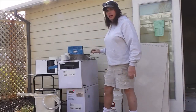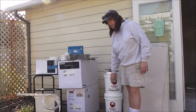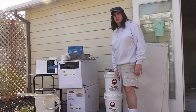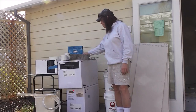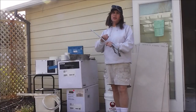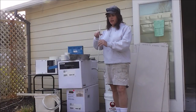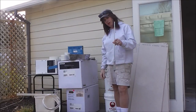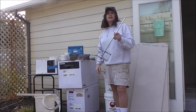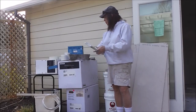When it comes time to finishing, you can see over here I have two 62-and-a-half-pound buckets of the drywall mud. I don't just use it directly from the container. I have my stirrer — I'll take maybe five pounds at a time, transfer it into another bucket, add a little bit of water to thin it down, and make it easier to use and dry slower. I use the paddle here to stir it.